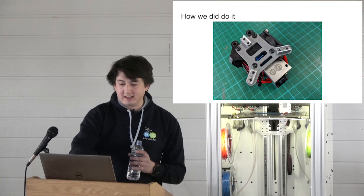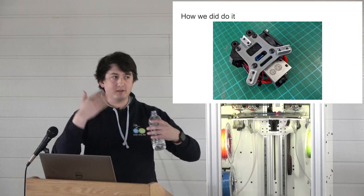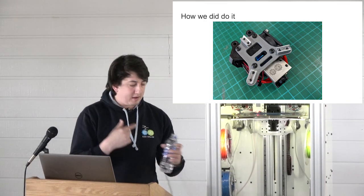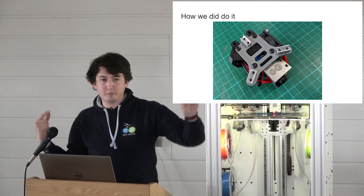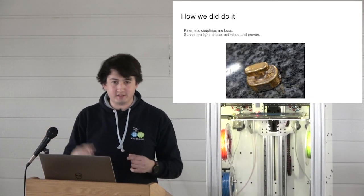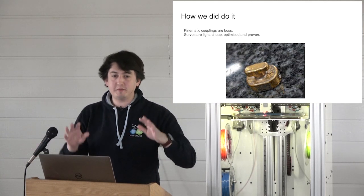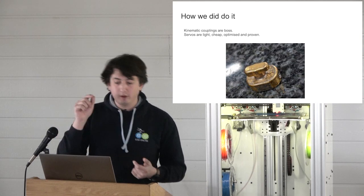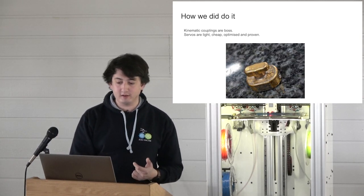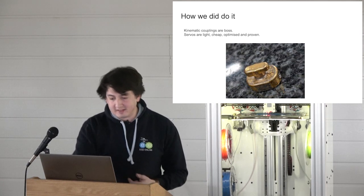And we wanted to keep this object 2D manufactured, in terms of base principles of manufacturing. If you can make it out of a 1-dimensional material like wire, that's the cheapest. If you make it out of 2-dimensional material like sheet, that's the second cheapest. If you have to make it out of 3-dimensional material like CNC milling or 3D printing, that's more expensive. We wanted 2D manufacturing on this part, so this is just a slot. Then there's this thing.